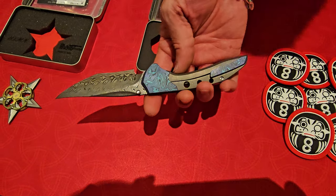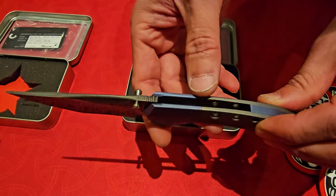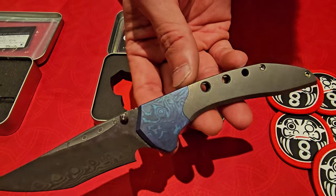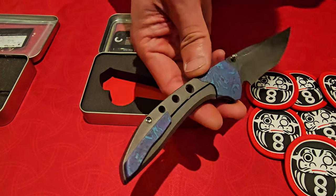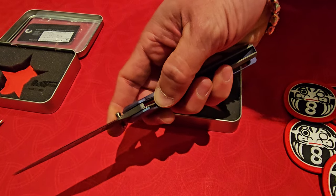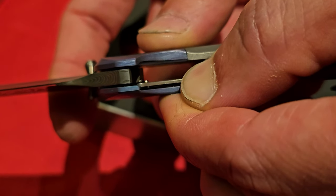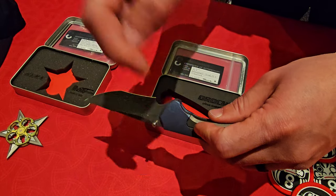This is a frame lock, but I have the bolster wrapped all the way around — you don't see the liner sticking through, and it also caps over the pivot itself. The material is Timascus — vapor blasted for a satin finish and then electronically anodized. That's also a Timascus backspacer. These actually have a little lock bar insert in there, and the detent is actually integral machined into the insert. That means you just remove this bolster and you can tune it by changing the lock inserts from this side — you don't have to unbolt the entire thing to replace the insert.